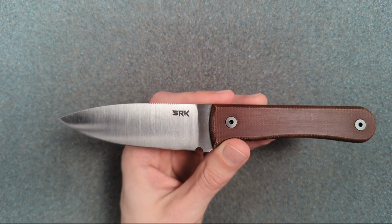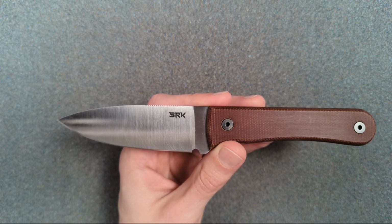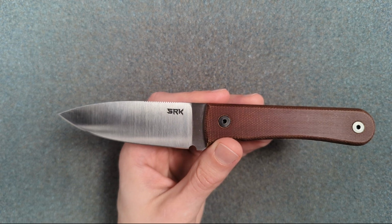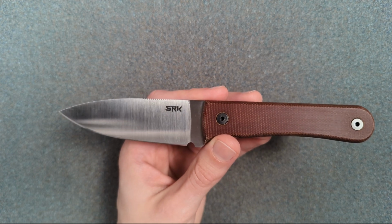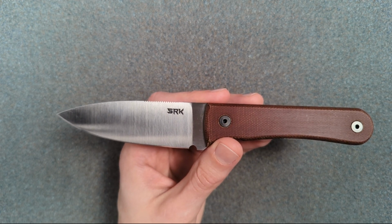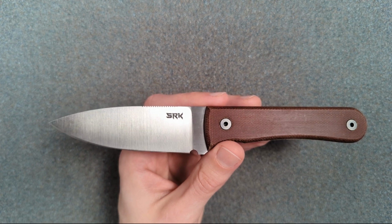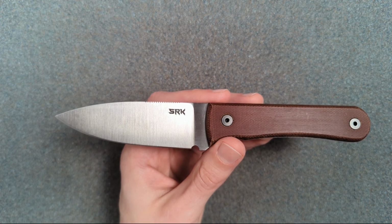This blade steel is, like I said, LC200N. It's listed as being Z-Finit or Z-Finite, but those are the exact same thing. It's a steel made by Zapp, a German precision metals company, founded in the 1700s, been around forever. I think technically it should be pronounced Z-Finit because it's just a portmanteau abbreviation. It literally stands for Zapp fine grain nitrogen steel, finit. And yeah, it's just a trade name. They are the exact same thing. But the reason why that's so freaking good for a knife that you're going to use in a food prep kind of situation is because it's practically impossible to rust.